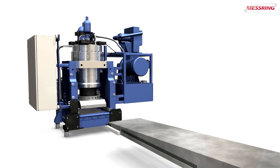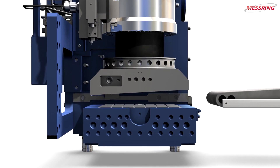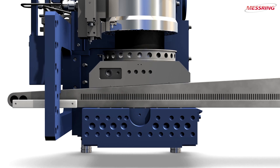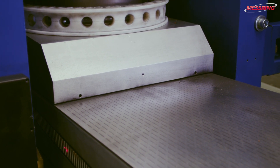The brake wedge, which is flexibly mounted onto the sled, is decelerated by the upper and bottom brake shoes in the system as programmed. A precise, highly dynamic hydraulic brake pressure provides the programmed deceleration.